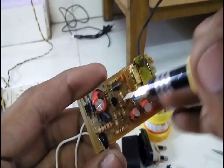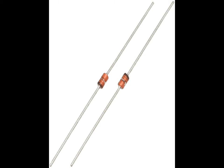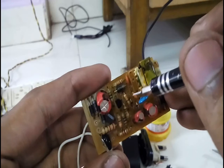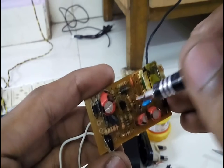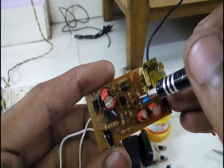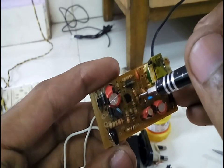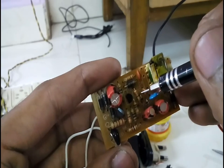To increase the output voltage, we need to search for the Zener diode, which looks like this. It is located here on the circuit board. To discriminate the Zener diode from a 1N4148 diode, look for the value 5V1 on the Zener diode. This indicates that the Zener diode is a 5.1 volt regulator.